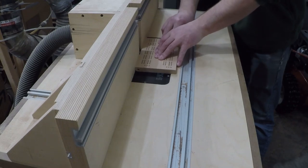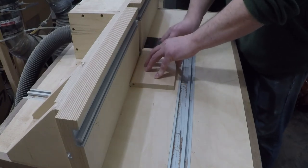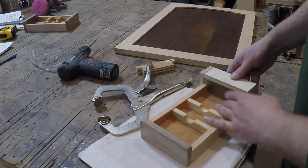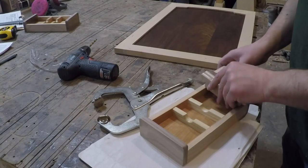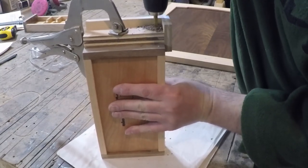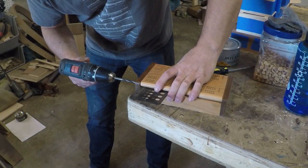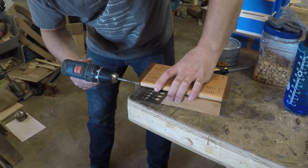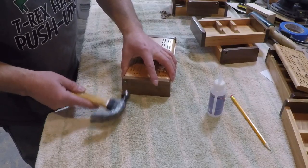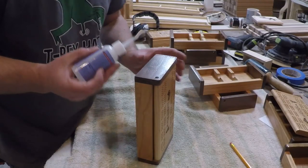I rounded over the front and back of the lid for two reasons: it's decorative, but also to allow clearance for the lid hinge to open. The lid will be hinged on a dowel pin, so I made a quick little jig to mark the hole locations for the dowels. I clamped a sacrificial piece of wood on the back so the drill wouldn't blow out on the inside. When drilling into the lid itself I used a 16th-inch spacer to position the lid — that space allows the lid to open freely without binding. Before final assembly I pre-finished everything, then drove a short section of dowel to pin the lid and glued it in place with some CA glue.